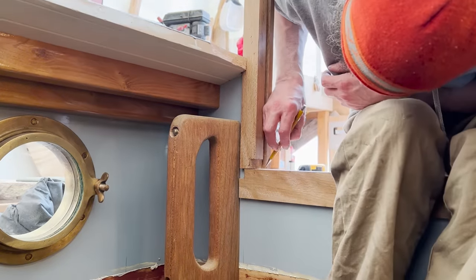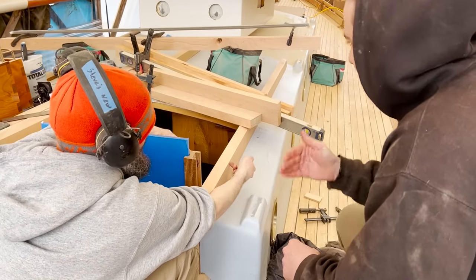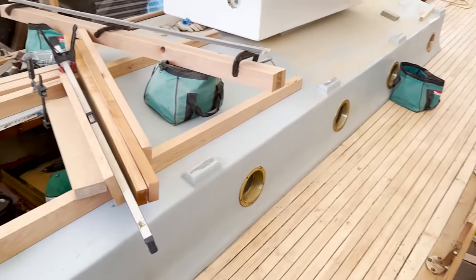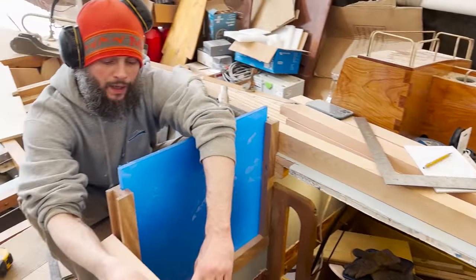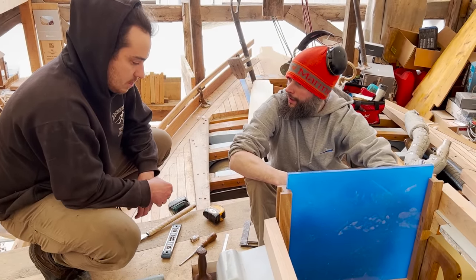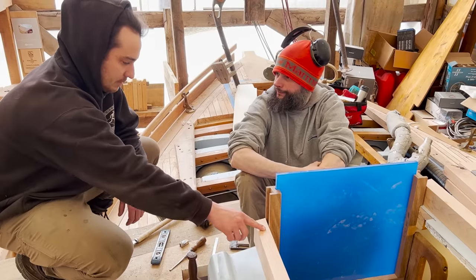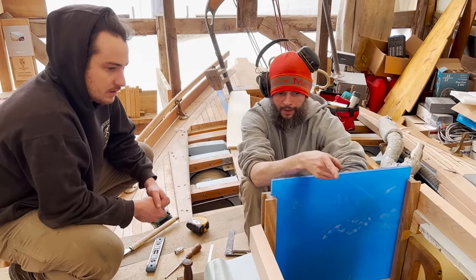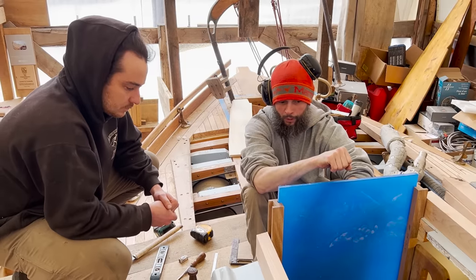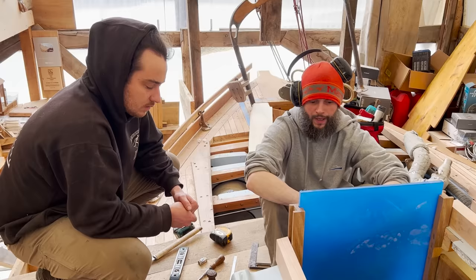Forward stop on the hatch, something like that. Yeah. I think what I'm gonna do is I gotta cut the grooves over here for the half round to go. And then I think I'm gonna cut a dado on the inside. And I'm gonna put four pieces of plastic or lignum vitae that go over and ride in those slots. Okay. And then that can be the stop, on both directions. Well, coming forward, the dam in the back will be the stop. Pulling out this way. Yeah. And then going forward, it would either hit back there, or I can put those stops in.